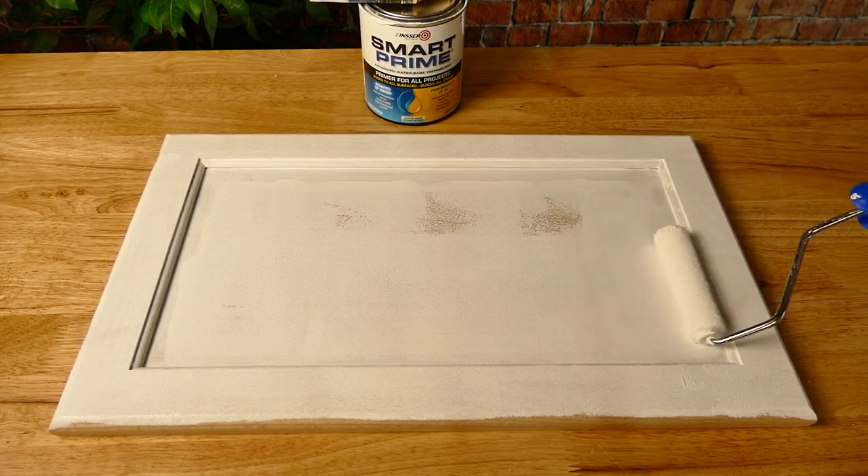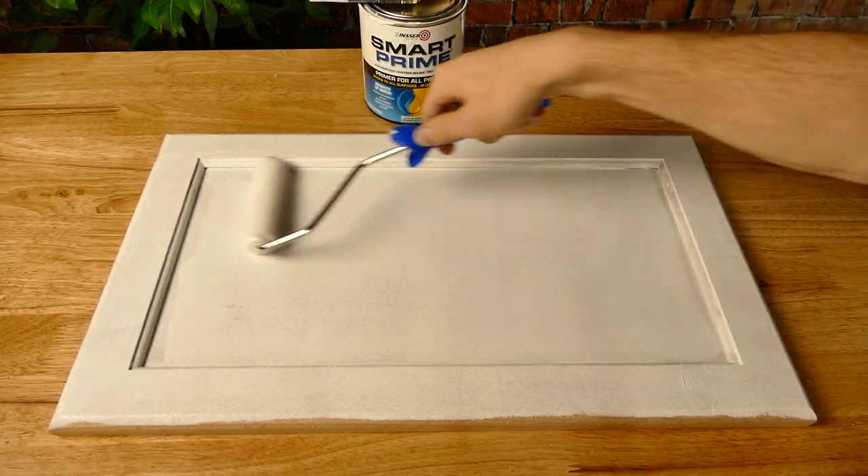Oak, which is one of the main woods I paint over when painting kitchen cabinets, is notorious for tannins that bleed through. Tannins are basically tannic acids that come out of the wood when moisture is present, and it looks like a brown stain in your paint — most noticeable on white finishes. In the past, water-based primers could not properly seal in these tannins, so you'd have to use an oil-based primer or spray can of Kilz Original to hit all the spots. But Smart Prime does a great job of sealing in these tannins.